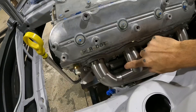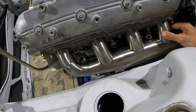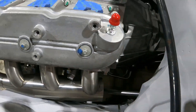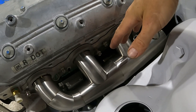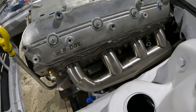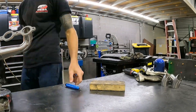I've got all my pieces cut and laid through the manifold onto the tube, and I wanted to mock it up one more time before tacking to make sure all clearances are good and everything lines up correctly. We come out at a pretty good spot. Nothing is pulling out of position naturally, so we should be fine. Once everything is tacked together, I'll bolt it to the heavy piece on my bench to keep the flange straight during final welding.